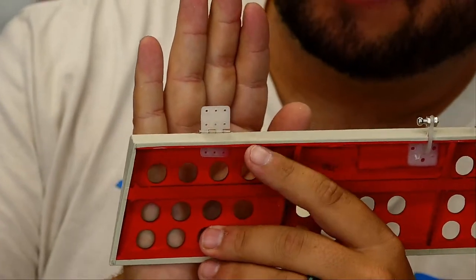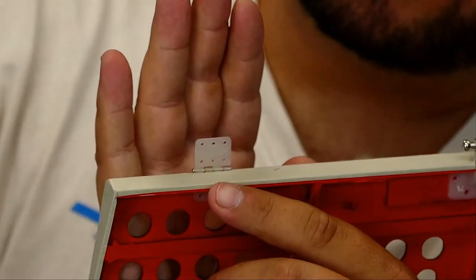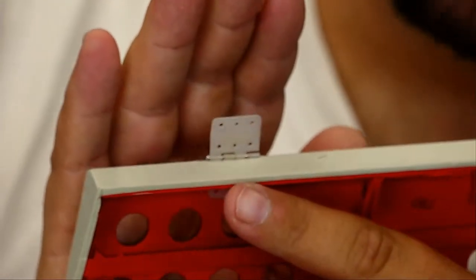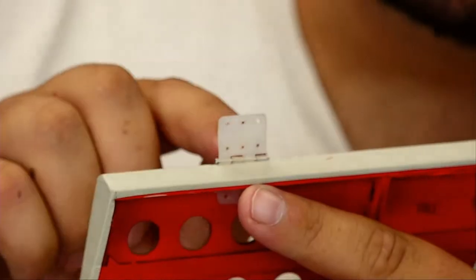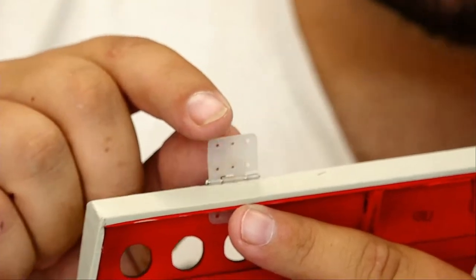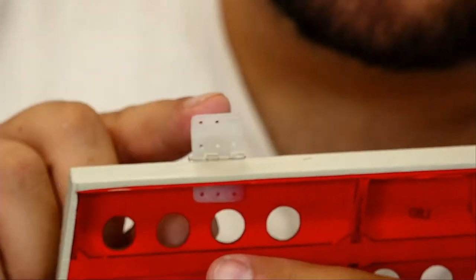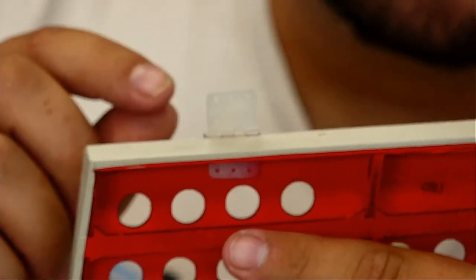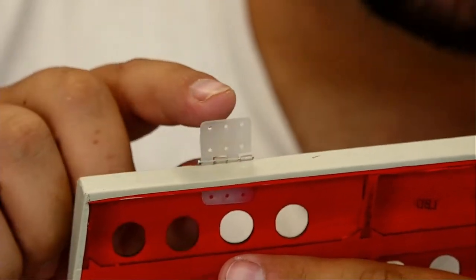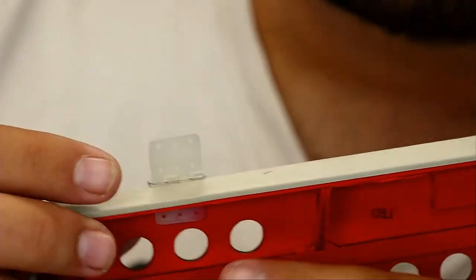Okay, there you go. So the way this works is there's like six holes in here. I never fill all of them. I only do one. So what you're meant to do, though, is you put your epoxy on here, you put it in the hole, and then you drill a hole into the wood itself, and you put a toothpick down through it. And you glue that toothpick in, and that keeps this from ever being able to pull out. But as you can see, it's got all the little holes in it. So if you're really good, you can hit them, but I never end up hitting them. I just try and drill right for the middle of it and put one right in the middle of it, and one toothpick will hold the world on these things once you get three of these hinges in there. That's what those are actually meant to do.